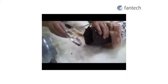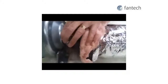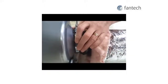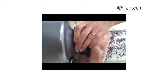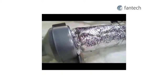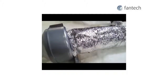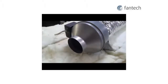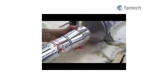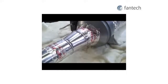Attach the 4-inch flexible insulated duct to the inlet of the fan using tape or band clamp, ensuring it's on securely. In this case, that the clamp is tight. The cover is pulled up and secured by tape. Attach the 3-inch exhaust duct to the fan using the second increaser reducer, ensuring that it is secured with tape and doesn't leak.